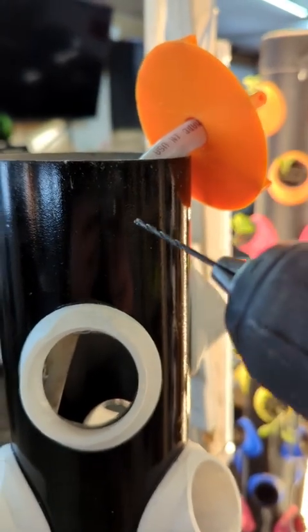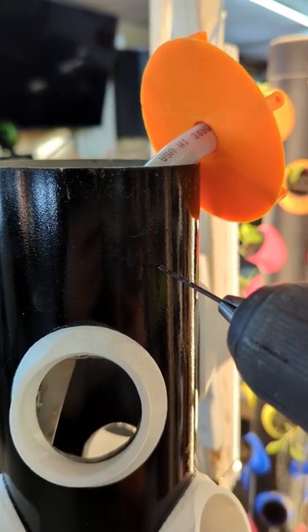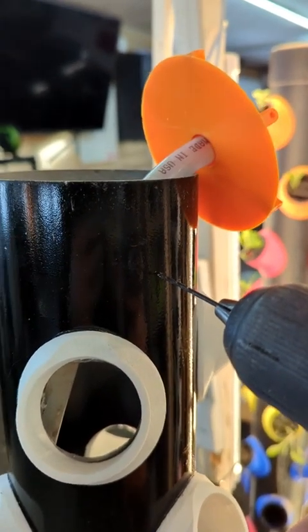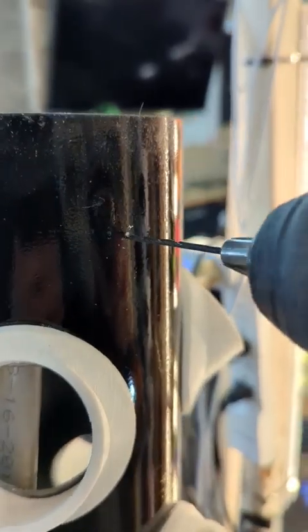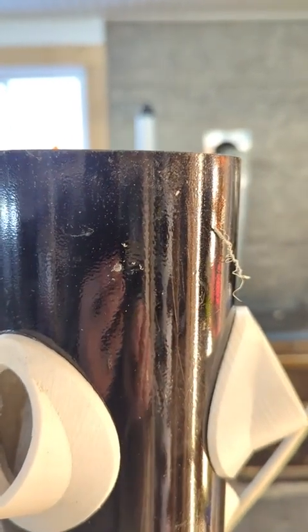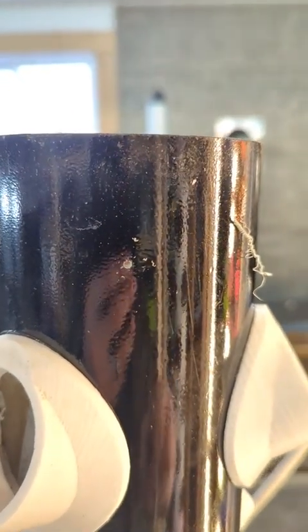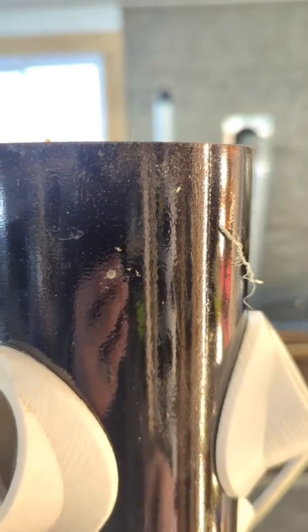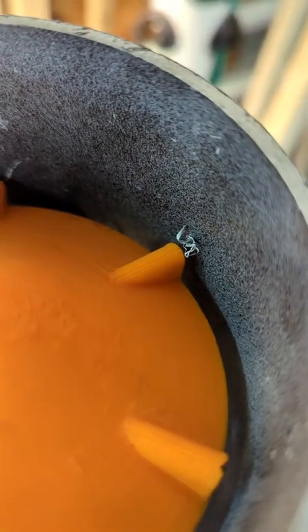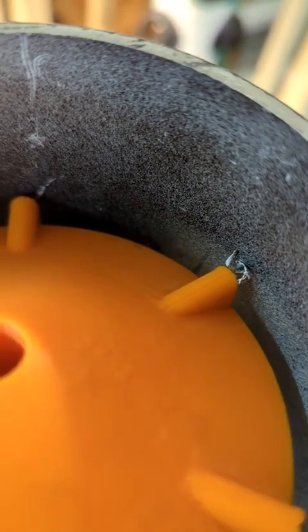You can pretty much drill your hole anywhere over here. I like to keep it about two inches down, so we're gonna drill somewhere around here for our first hole. Once the pilot hole is drilled, all you have to do is insert the screw till it almost pokes out on the inside, then line up the diverter and tighten it a little bit — but you want a gap all the way around the inside. You can see the screw just poking its head out from the inside of the pipe. We're gonna insert it into that tab right there and try to leave a space all the way around the diverter on the inside of the pipe.